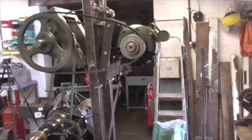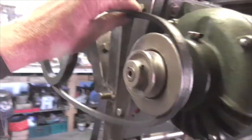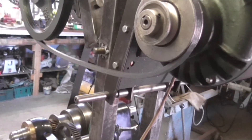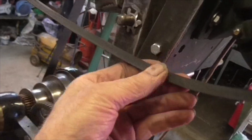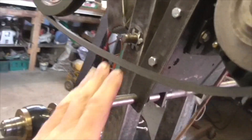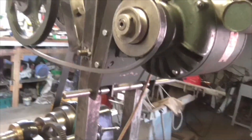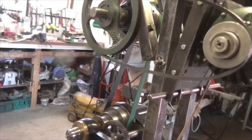Afternoon folks, Friday. We've got a belt - or at least a couple of belts. This one is the larger of the two and it will slip, but it's not necessarily particularly good at it. In my research on V-belts I've found that you can get a V-belt with a textile coated side which is designed to slip on all but a full wrap. I may eventually go for one of them.